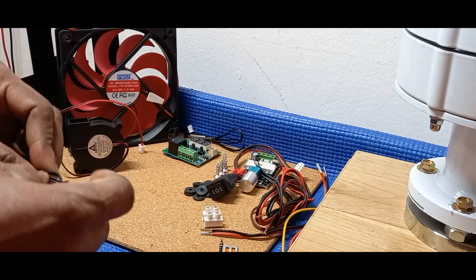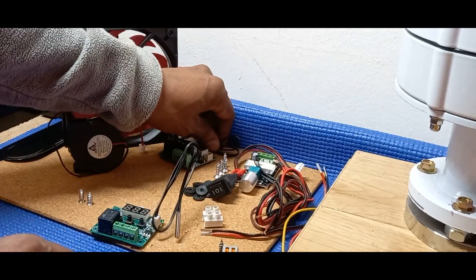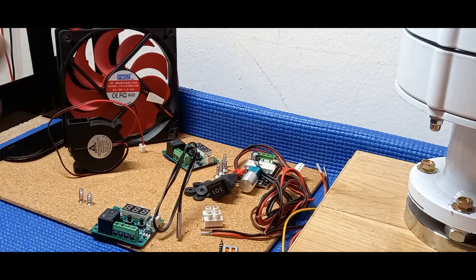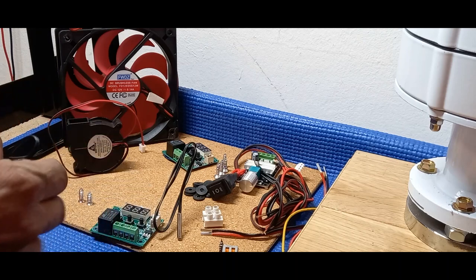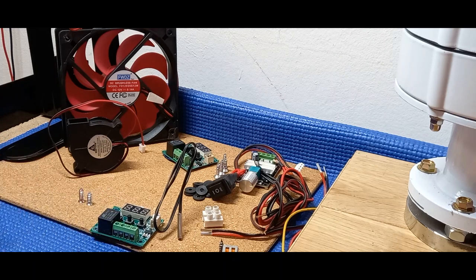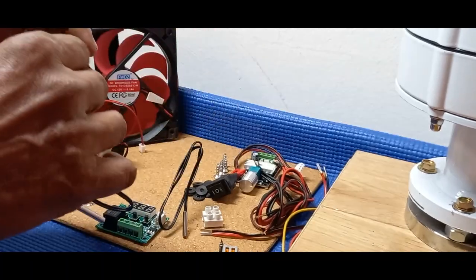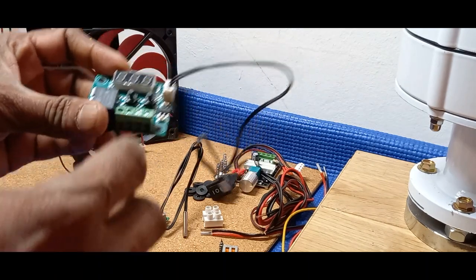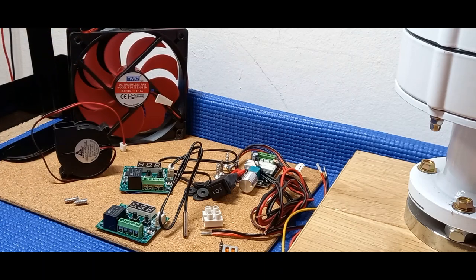It's easy to install. This sensor cable connects to this bracket, on this green connector from the right. Connect the negative power cable, and next to that, connect the positive power cable. The other two poles you can use for the ventilation or any other relevant load. The negative or positive doesn't matter on the load connector. I am using two fans as a cooling unit. Let's create a vent unit with this thermal controller.